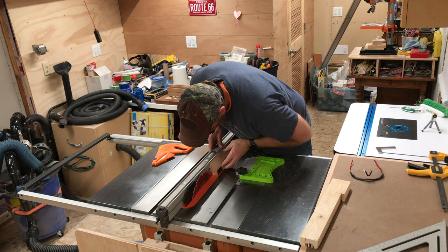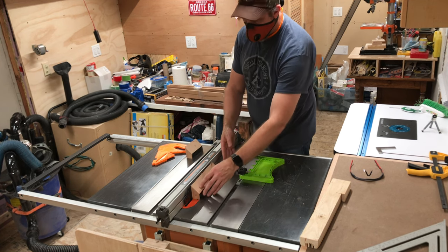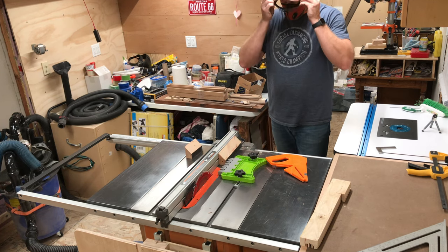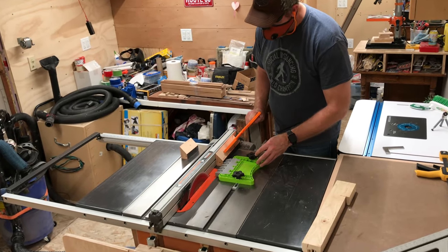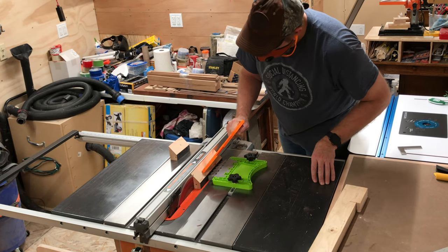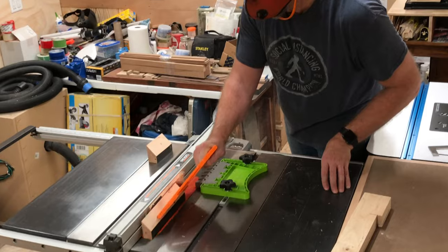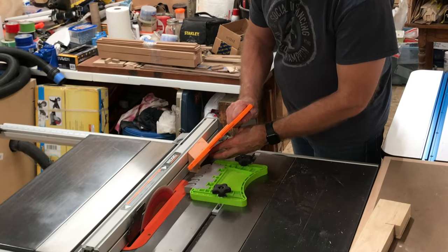However, if I had rotated this piece around so the off-cut would be on the outside of the blade, the bevel on the board would have been angled toward the rip fence and I wouldn't have been able to maintain firm pressure toward the fence. So instead, I set the fence so that the thin off-cut would be between the blade and the fence. I knew that this would probably cause the thin piece to come back toward me and I was prepared for that. I made sure I was standing off to the side so the loose piece wouldn't hit me, and I also used a feather board in front of the blade to keep the workpiece up against the fence. And as I predicted, the off-cut did come back at me, but luckily not too forcefully. I'm an unpaid amateur — don't try this at home.